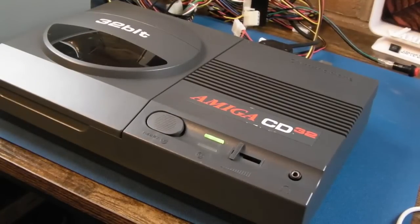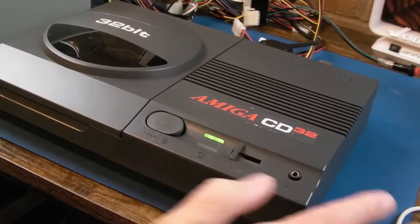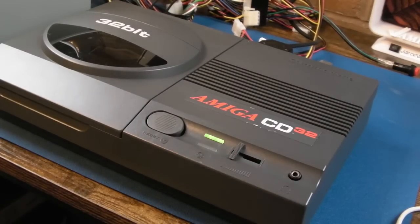So yeah, just a bit of a bonus thing there at the end of this recap, that if you do get problems with some sort of card like I was experiencing here, just run through the motions really, you know, check all the cleanliness of the connectors and the slots and things, but do consider reflowing certain things on there. In my case, it was just the crystal. I think I got that card from Super Duper actually, so I'm very grateful. It's just one of those things really, that crystal, when it was assembled, he probably did that in a hurry, but you can see it's every single time. This was not happening.